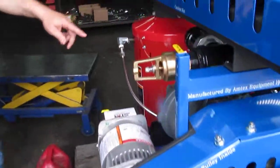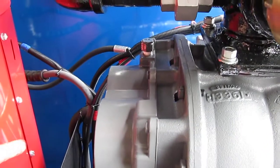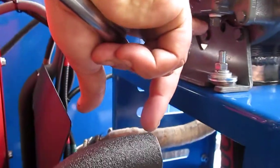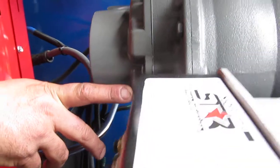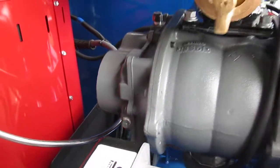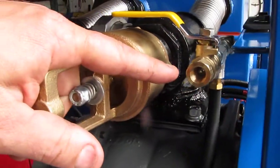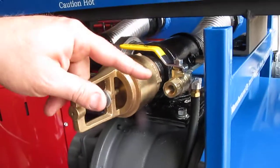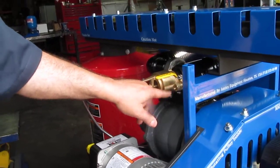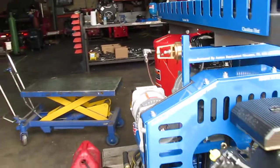Your blower takes 14 to 16 ounces of 75W90 gear oil. This is where you fill it, this is where you drain the oil, and this is the level indicator — as soon as oil comes out when you put the new oil in, put the plug back on. This port here is to lubricate your blower. After the daily job is done, it's always good to run about five seconds of WD-40 or any kind of lubricant through this port while the machine is running.